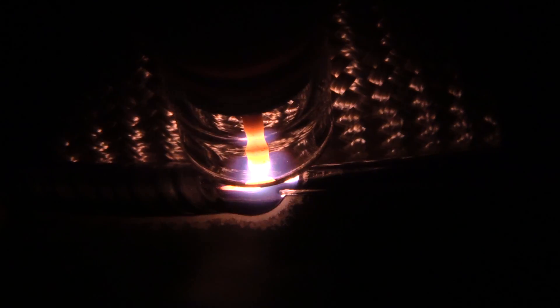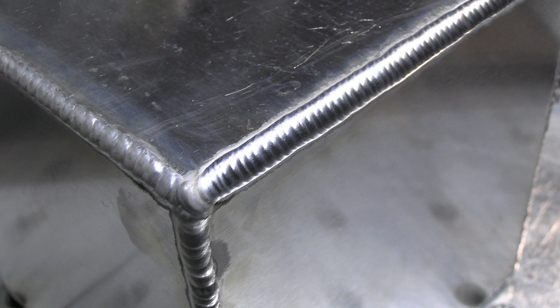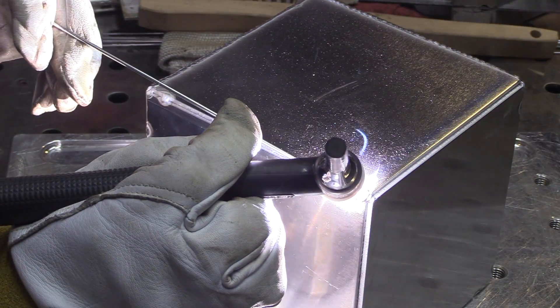Here I'm just walking over the rod, trying to move along at a fairly steady clip, sliding along with that TIG finger. You can see me looking through the cup — that's a huge benefit on certain areas, like when you're welding down in a corner where you can actually see through the cup and feed wire and see what you're doing. It's not completely necessary on an outside corner like this, but it just helps me with filming so that we all can see everything.